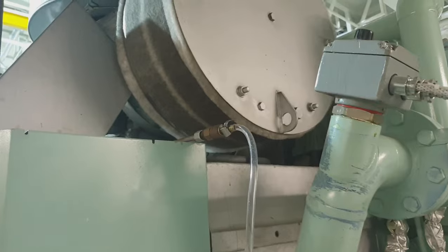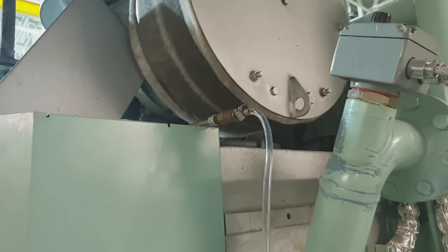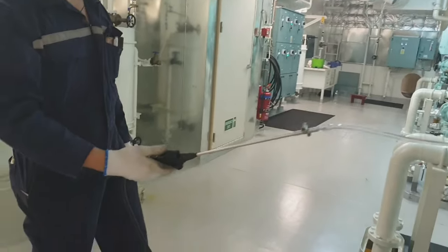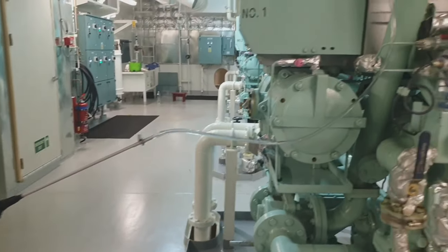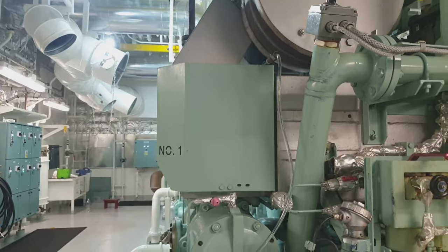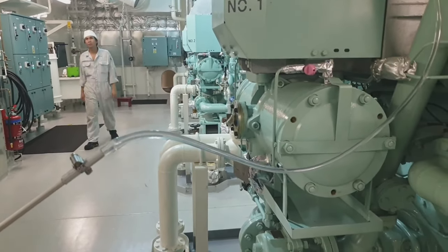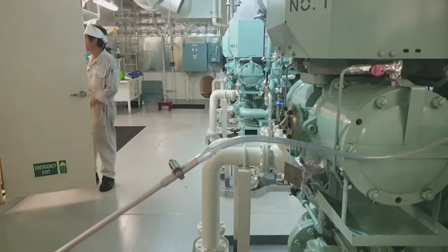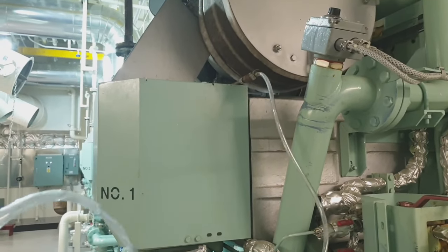At approximately 30 seconds the water will be completely injected. This maintenance is to be done according to observation — when you see that there is a difference in charged air pressure, or a drop in the pressure of the scavenging air or charge air, that means we have to clean the compressor wheel by this procedure.